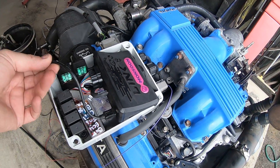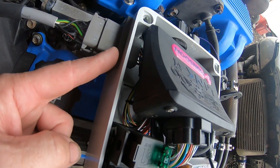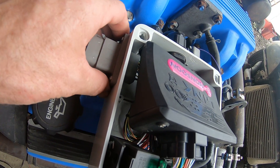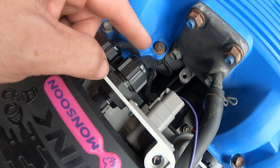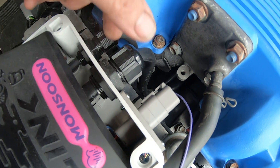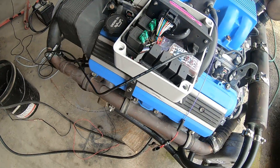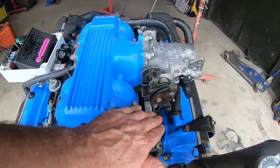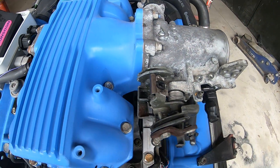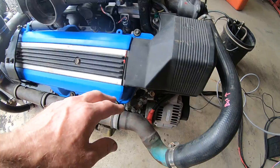We can't get the tuning cable out with the lid on, so that's why the lid is off. There's been some interest in how I've sealed this up — I've got these flange-mounted DT plugs. The main engine harness, whilst wrapped in Raychem, goes through this gland done up reasonably firmly, and the vacuum hose has gone in the same way. You can see the wiring's all very tucked away. Covers are on because I used the Yaris coils — the alternator fits up nicely.